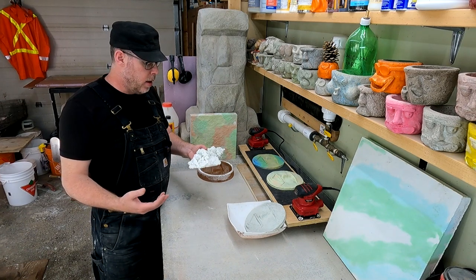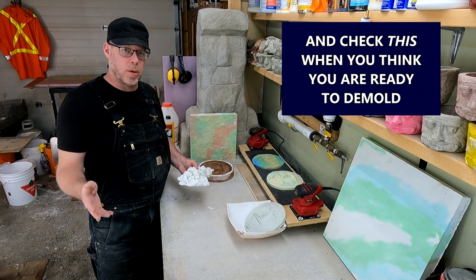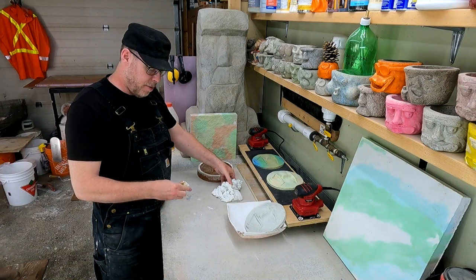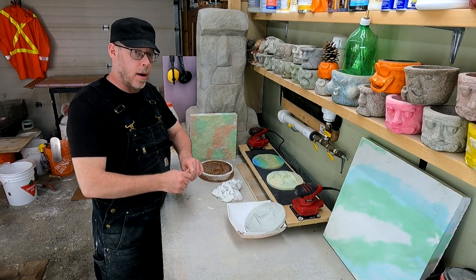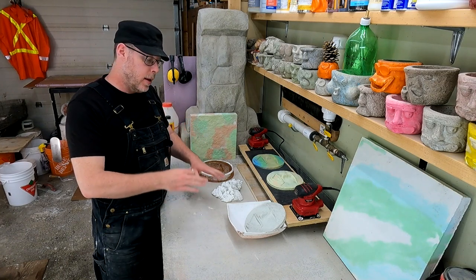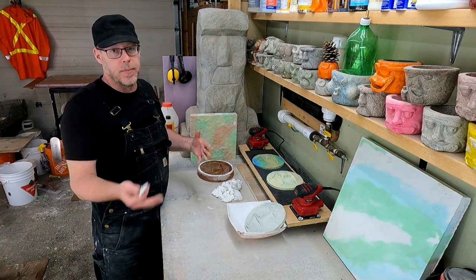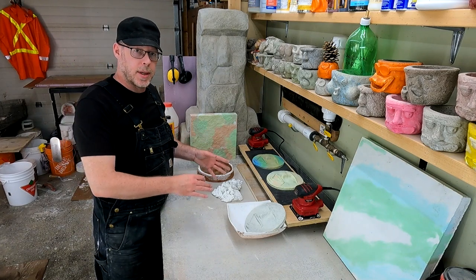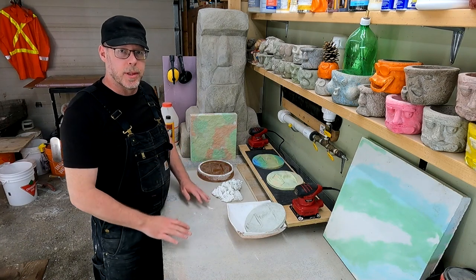You've always got a little bit left over anyway. So when I'm ready to demold — when I think it should be good — I'll go to that test piece and break a piece off of it. How strong is this stuff? It should be pretty strong. If it just turns to sand when you apply force to it, it's probably not ready yet. It could be cold, or you might have a mix design that's taking a little bit longer to set up. Give it more time.